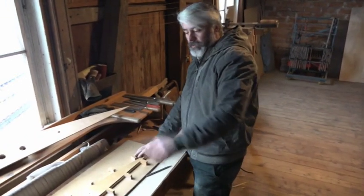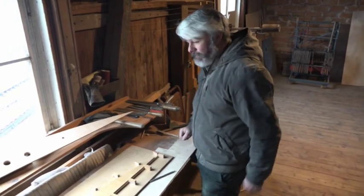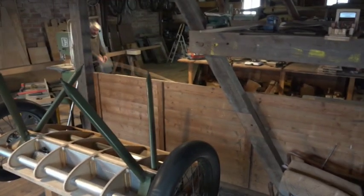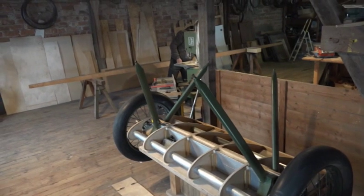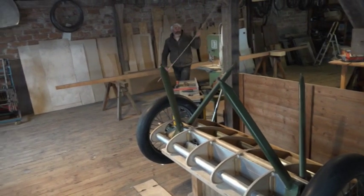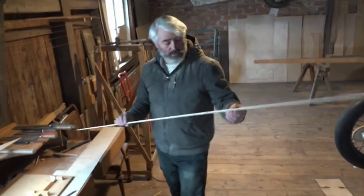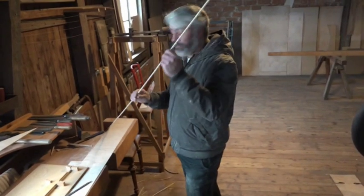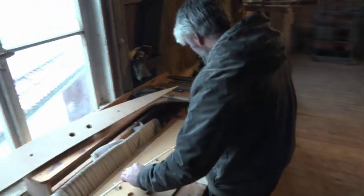So I will now prepare one of the cap strips, which I put into the jig to make sure that all fits together. For this we take one of the recently cut cap strips. These are the unwrapped 5x5 mm lime wood. The fabric wrapping will be done once they fit into the jig.